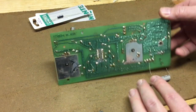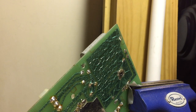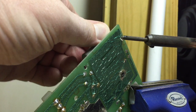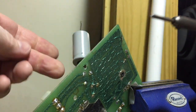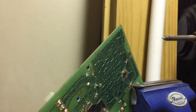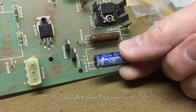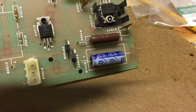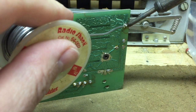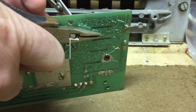I'm going to desolder these starting on this backside — just take them off and put the new ones on. To remove the capacitor, I've got the board secured lightly in a vise. I'm heating up the solder side of the board and just pulling on the capacitor. We're not going to reuse the capacitor so I'm not really worried about the heat from the soldering iron damaging it. We're going to clean out the solder holes and put the new capacitor in its place. After cleaning out the holes, just take the new capacitor, bend the leads and insert it right into the holes. Put a heat sink on the leads to protect the new capacitor and do the soldering. Trim the leads and we're done.